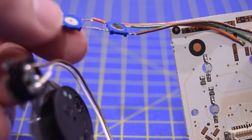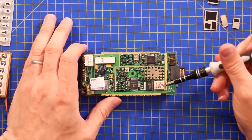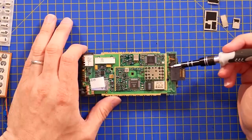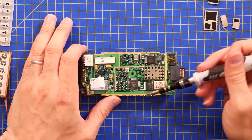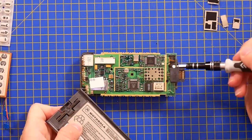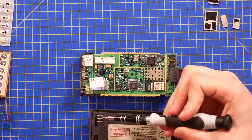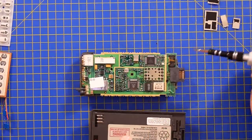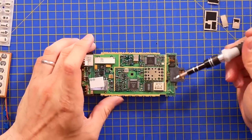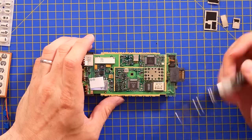Although the volume switches on the side, they are actually really low-rise tactile switches. So with the power coming in here, guessing that's power management — looking at the traces, makes sense. You've got battery positive running across here through a resistor, providing a positive plane all the way up there. The one closest to the centre is positive. I'm pretty sure that centre one would be an NTC thermistor, just monitoring the battery temperature while charging. Then the negative on the outside connects to a ground plane, which presumably floods that entire side of the board.